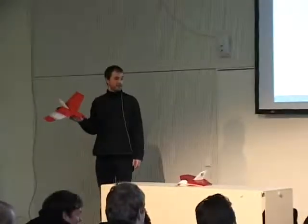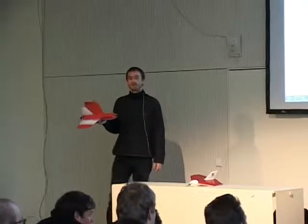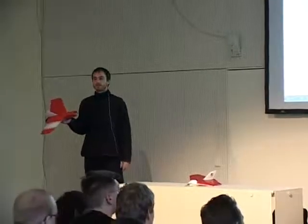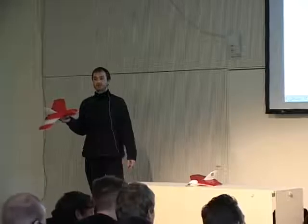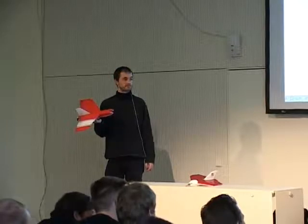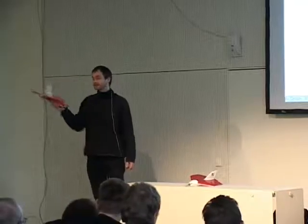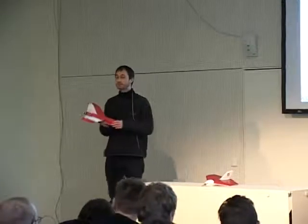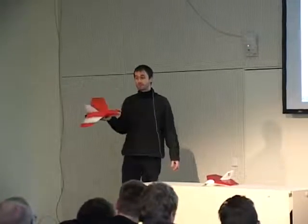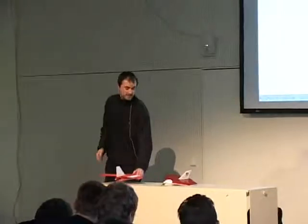Safety is always the most concerning. That's why we're not flying on the Alexanderplatz. And you probably saw in the pictures the places that we were flying at were far outside, far away. And we have two data links up to the aircraft. We have simulated everything before. Of course, this is not the same as the 30 million Global Hawk aircraft that the U.S. Army uses, and still they crash. And we are talking about a 300 gram aircraft, so even if it falls on your head, you should not be injured a lot. Given the size of the aircraft, we cannot double or triple every system. So we are doing our best. We're using formal methods. We're using analysis.